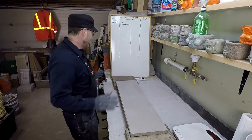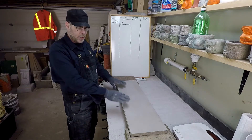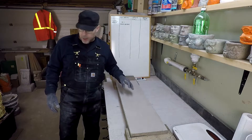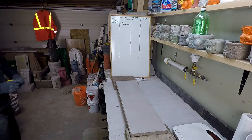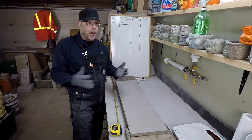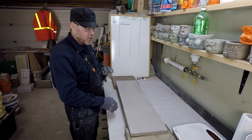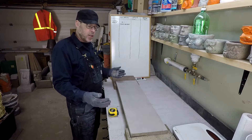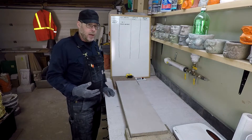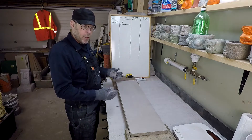I'm so excited, I don't know where to start. First things first, this is just mortar — this is our control block or control brick here. What we're going to be doing today is breaking things. I have a 28-inch span, and the test block is a one-inch thick piece of mortar — it's concrete, essentially. Three parts sharp sand to one part Portland cement.